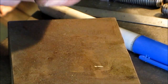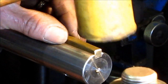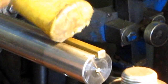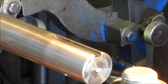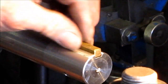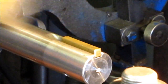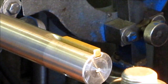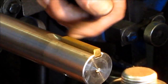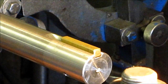Now we test it into the shaft. Now I'm happy with that fit. When you're tapping it in, make sure that none of the brass chips raise up — if they do, blow them away. You'll be prying your key back out and putting it back in and double-checking it. Then make sure that you're not key-bound.